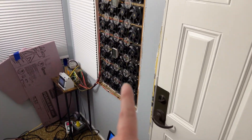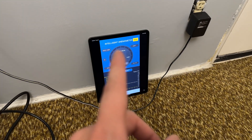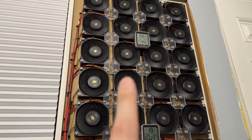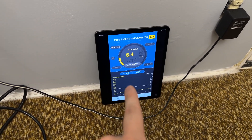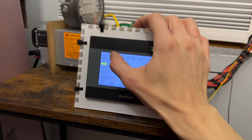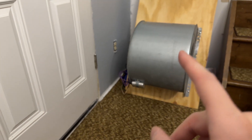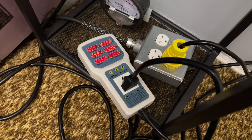I yanked the squirrel cage out just to verify with the custom fan array. Back to the same conditions, same meter. Reading zero at the moment — I'll plug the power supplies in. This is running at minimum speed with all fans on. At minimum speed: 101 watts, 6.2 to 6.4 miles per hour, 8 pascals. So with the squirrel cage I was getting 20 pascals at 1,100 watts. Here we're already over 20 pascals at just 200 watts.